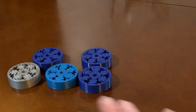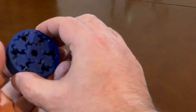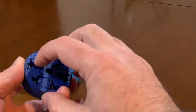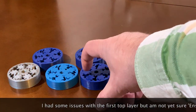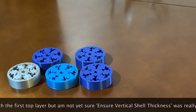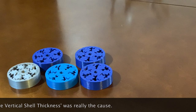So that was what it was for this gear, and I learned two things. For some of the parts where you need extra tolerance, you've got to be careful with that Ensure Vertical Shell Thickness setting, although it does come in handy - especially if you're using low infill and you want that top layer to have that extra little bit around those thin walls to grip onto. If you don't have that, I've had some issues where the top layer didn't make it all the way to the end and only stops at the last piece of infill. So if you're using something like 10% infill on a big part, that could be a problem. It's not a terrible setting to use - it's just that in certain parts, you've got to turn it off, and that's what I'm learning.